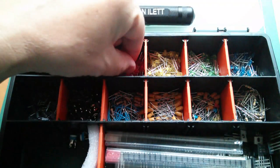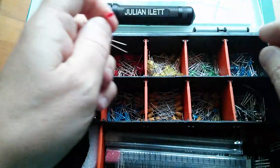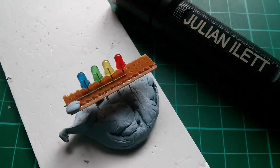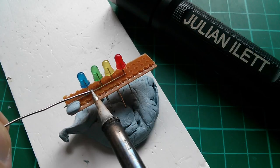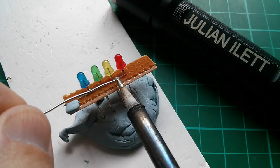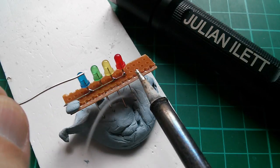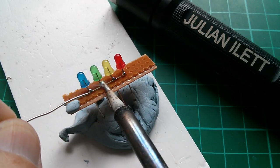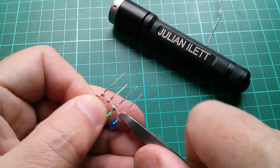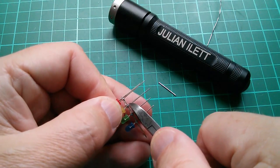Good morning. I'm just getting some LEDs - I want a red one, a yellow one, a green one, and a blue one - one of each. I'm going to solder a wire onto the legs of these four LEDs. It's not very well held together but it's probably good enough. Blue, yellow, red, and green. Everything's a bit tarnished so it's not soldering very well. I'll just clip these wires off so it's nice and neat - my little array of four LEDs all wired in parallel.